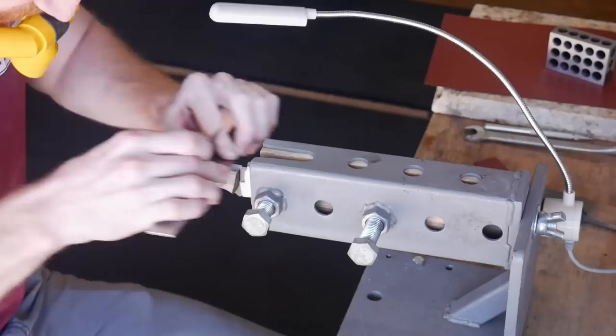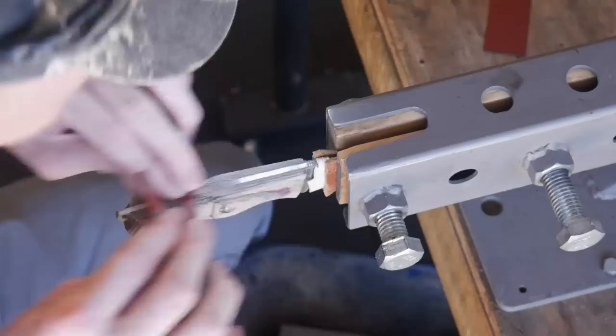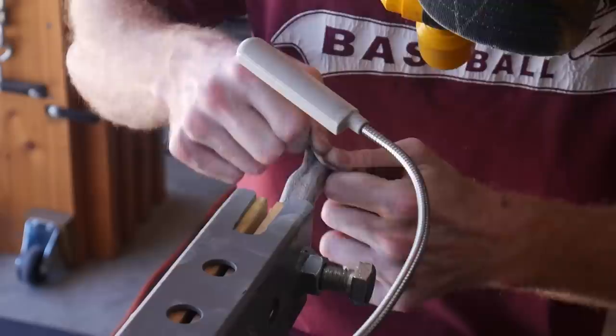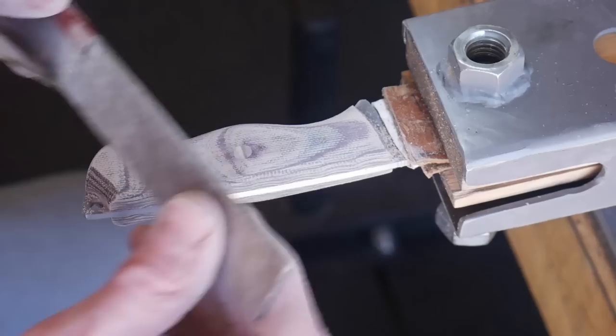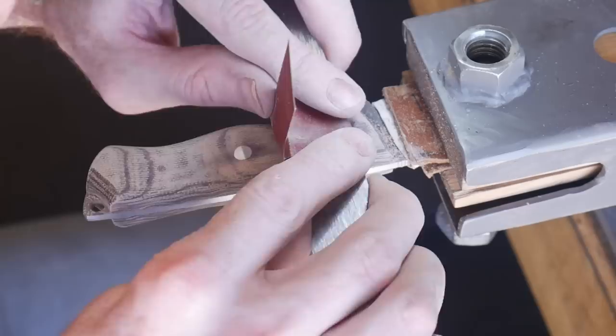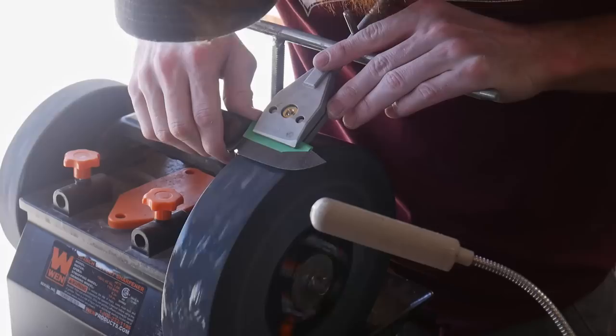This is how the knife came off the grinder. Then I work up the hand sanding grits from 320 grit paper to 600 grit, and finally to 1000 grit paper. The top and bottom of the knife are fairly simple, but I take great care on the sides because I don't want to dome over that stainless steel Corby fastener. The stainless steel is harder than the micarta and you'll feel it in your hand, so I use a hard metal backing - surface ground - to my sandpaper.